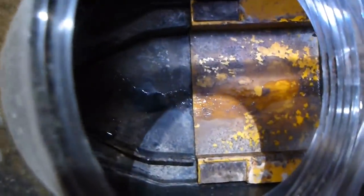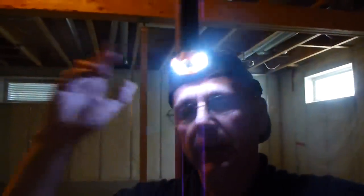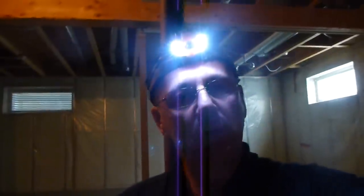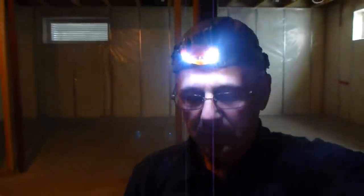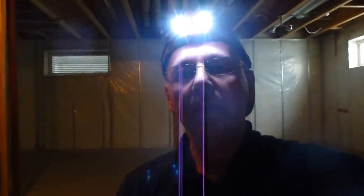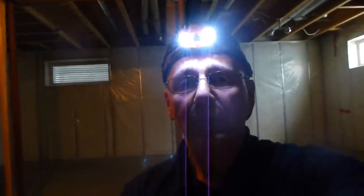That's why I tell homeowners: when you have these valves, you should once a year turn on the taps with hot water, get some soap in there, put on some rubber gloves and a scrub brush with a long handle, and go in there and completely clean out the flap and all around it and underneath it. Make sure it's completely clear, clean, and very free and loose. Otherwise, you don't really have sewer backup protection.